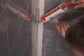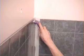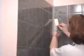Now silicone the joint. Does it matter in which direction you move the caulking gun? You should push the cartridge like this, into the seams, forcing the silicone into the joints. Now for this handy caulking tool. Which tape should we be using? We'll use a wide tape. That way, any excess silicone will not spill onto the Barker tile and will simply be removed with the tape.